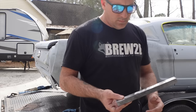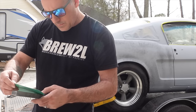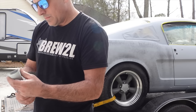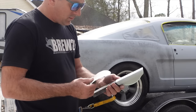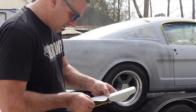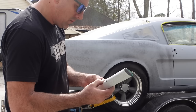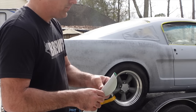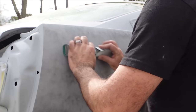I have a block here and we're going to attach some sandpaper to it. I'm choosing to use 180. You can take the disc from your sander — you can either cut them down or just wrap them around the block like this. They don't have to meet up perfectly, but you want to make sure they don't overlap. Just butt them up together and this works perfectly fine — you don't have to have one big long sticky sheet.